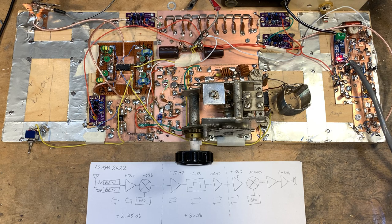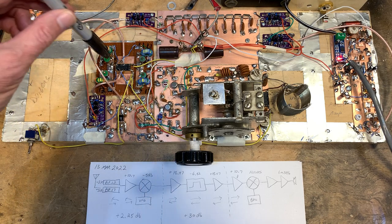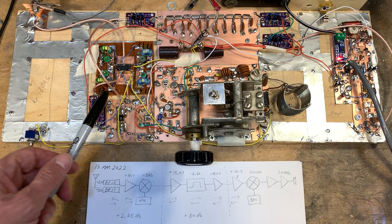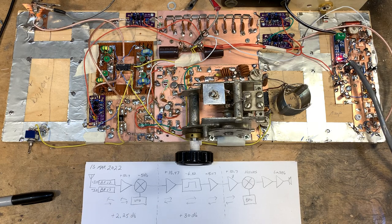And that is the website of Hans Summers, G0UPL. Hans, his company, sells little kits for bandpass filters. I highly recommend them. He just uses a basically DTC, Delta Tango Charlie, dual tuned circuit approach. Basically two tuned circuits, and you can see this is a 12 meter filter here, one tuned circuit here, another tuned circuit here, joined by one small capacitor and with impedance matching handled by link coils wound atop the coils that we have for the main LC circuits.